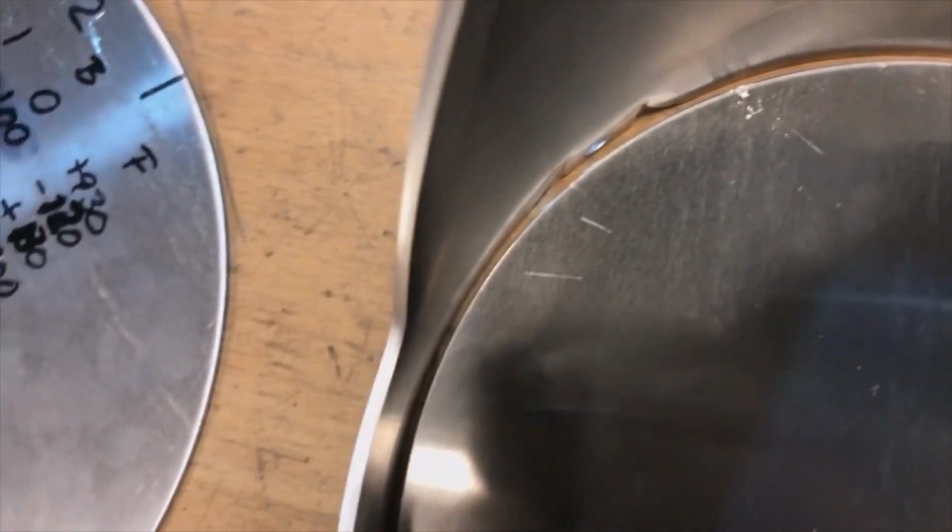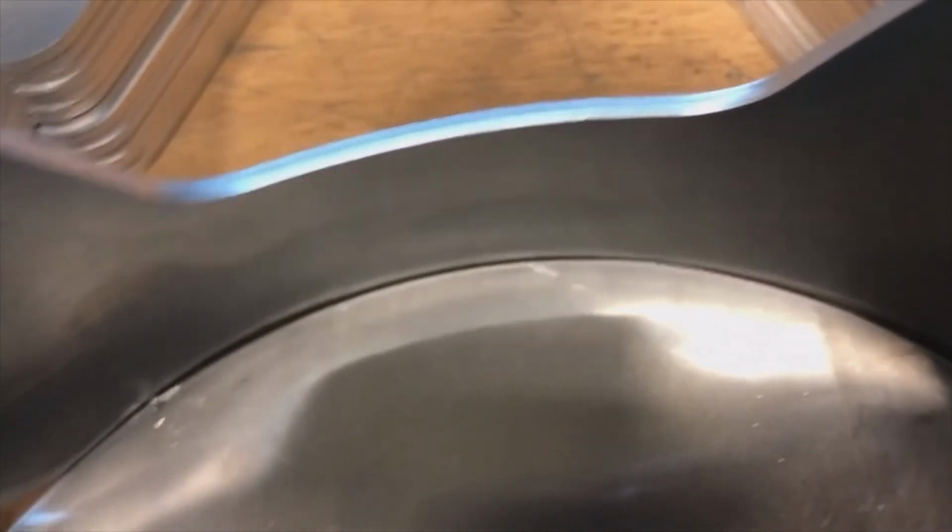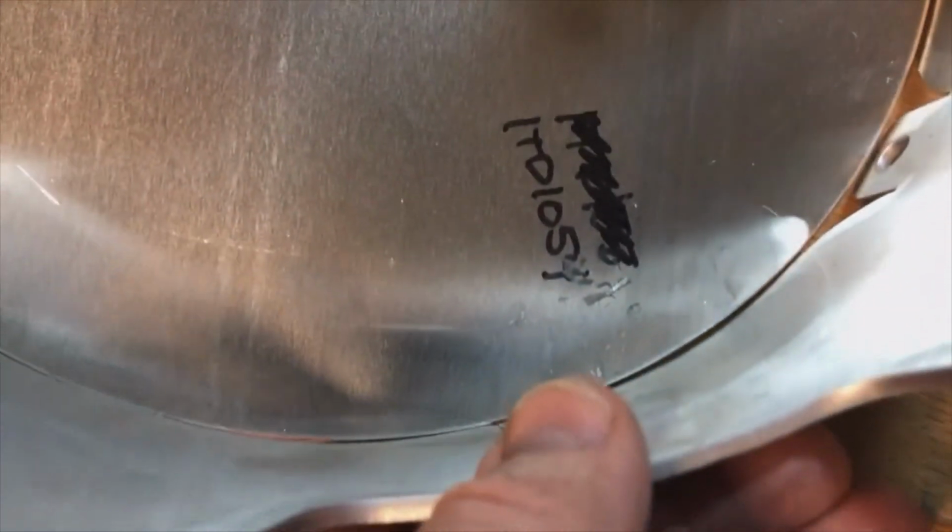And again, you see that your blank is a little bit too large, right? So the bottom actually complies pretty good to the radius. Again, you are a little bit over here. You are a tad under here, but not bad overall. And again, you're a little bit over here. And then it fits. Move this around so that I can go this way. Then it actually fits very nicely here. So it's more that we are overbending here than anything. And then you have a little bit of funk going on here, but not bad either.